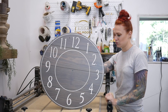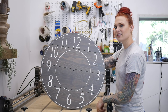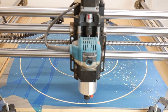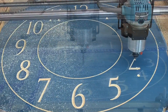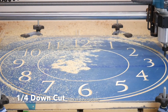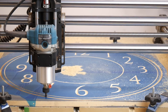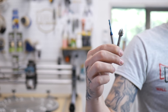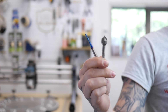Here we have our third item you can use your CNC for: CNC clocks. This is one design, and there's also a nice big blank spot in the middle where you can have family names or monograms — anything to your customer's desire. For the bits: I use an 1/8 inch down cut bit to cut away most of the material, as well as the hole in the center of the clock and the circles around the design. Then I go in with the 90 degree V bit to finish up all the small details.